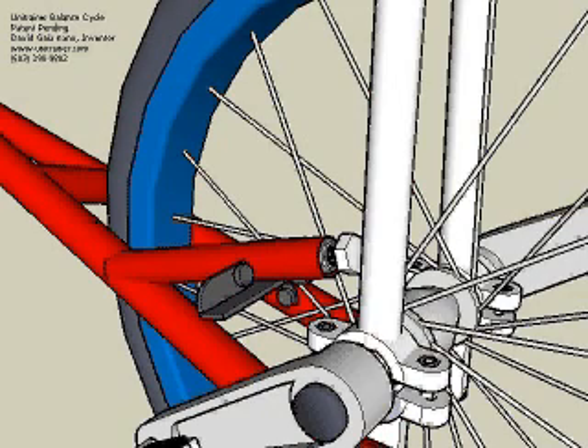The left side of the frame has an assembly that limits the forward rotation of the unicycle to ease mounting and starting. The rear end of the assembly has an adjustment bolt so that the amount the unicycle can tip forward can be varied for different height riders.